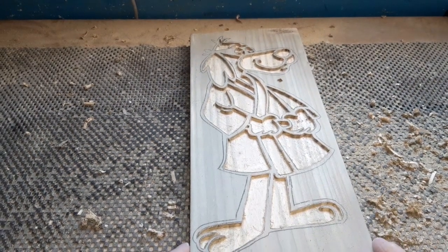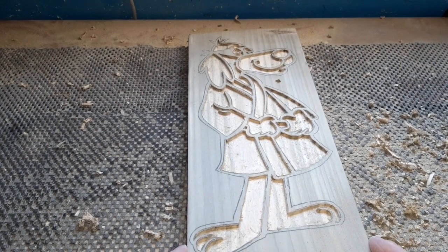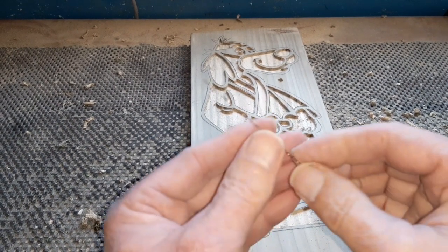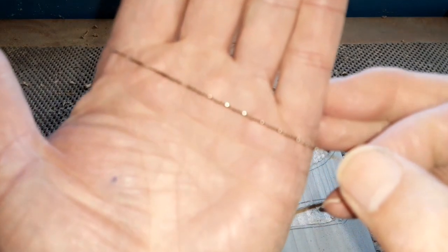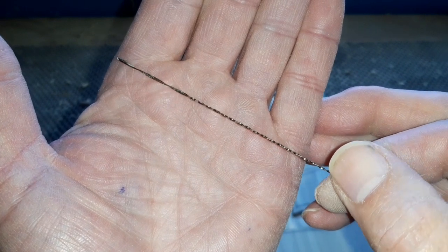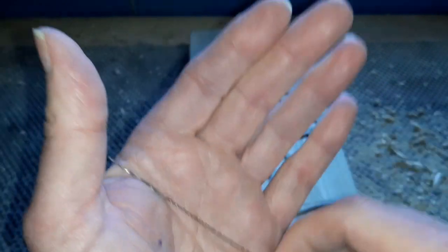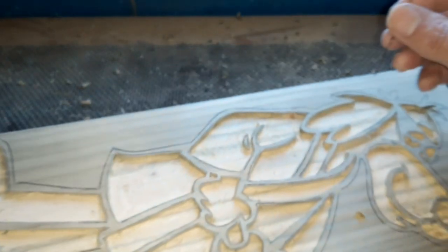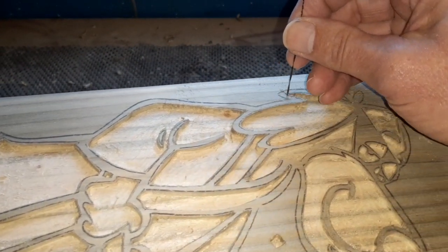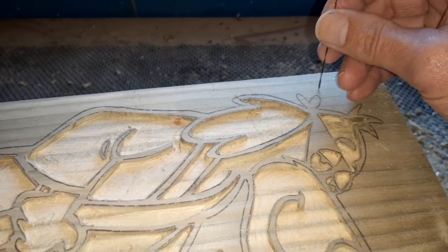Now for that, I like to use a spiral blade on a scroll saw. Like I say, the spiral blades, they're not for everybody. The good thing about the blade is they do cut in any direction, as the teeth spiral the full length of the blade. So you could actually put that into your saw, just here, and then just start cutting, and then coming down.